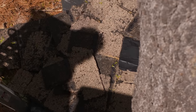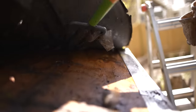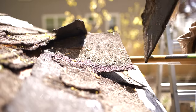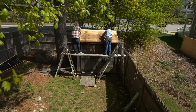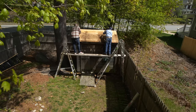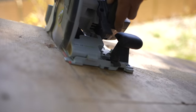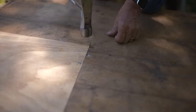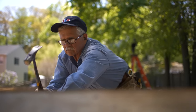The roof is wet under here — that means the shingles aren't doing what they're supposed to do, so it's time to replace. Another thing: there's no underlayment between the underside of the shingles and the surface of the sheathing — you need that as a separation. After pulling out the staples and stripping shingles off the other side, we can replace the damaged section of sheathing. Now that the piece is cut, I insert it into the opening and nail it off.